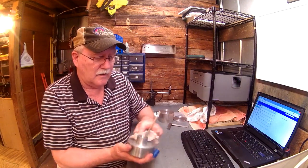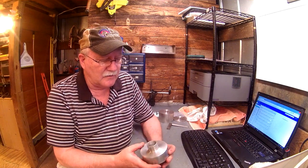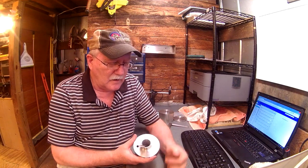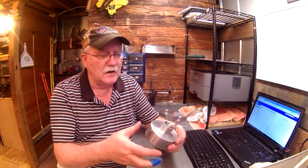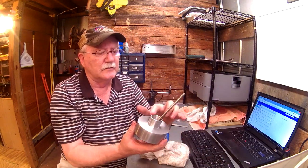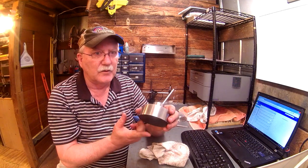So, second time around, I built the 4-inch one. Did the same thing. The only difference was I started out with a 1-inch hole in the top, and then I actually flared that hole. I cut it at an angle, so I've got a 1.25-inch opening for the brush down through, and again, this is all hollow, and everything you're seeing here is one piece of material. It goes down in there, all this is one piece. The second piece is actually the bottom, which is going to be pressed in.